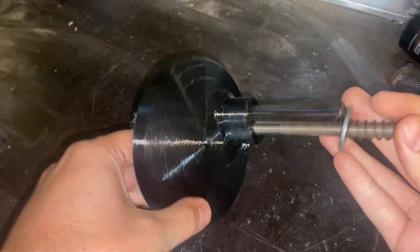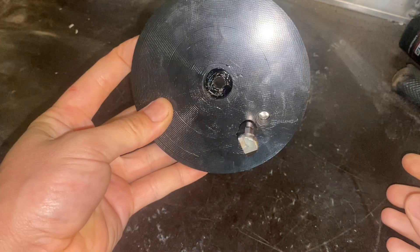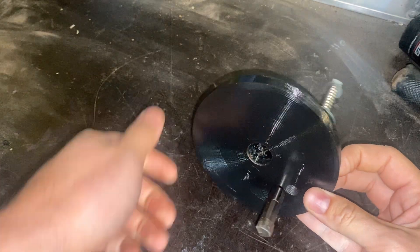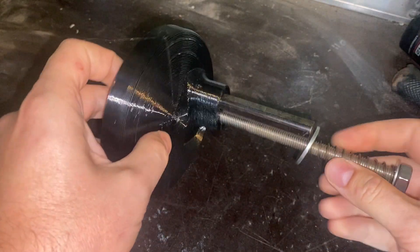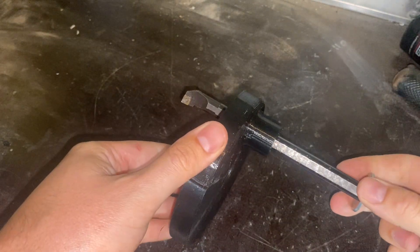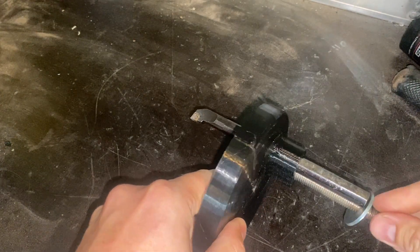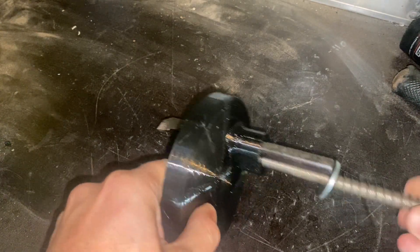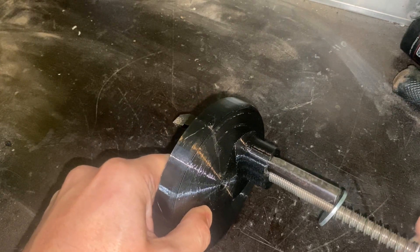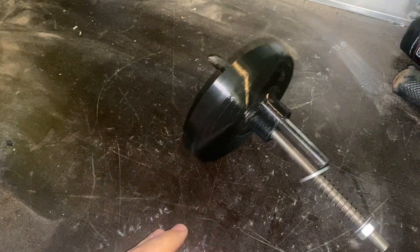Just like that I've got my assembled 3D printed snout trimming tool — pretty rad. We've got a three-quarter bore here to go over the shaft that'll just knock on. The threaded rod here basically just adjusts the spring tension against this boring bar. It'll push it through as the pressure releases, and I can just keep tightening that nut down to keep pushing it along, apply that pressure, and then spin it on there by hand.